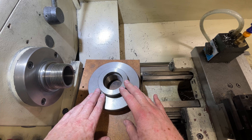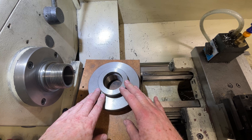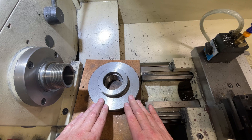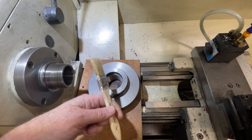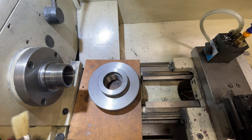If chips push the plate out of position during machining, then when I put it on the chuck next time things will potentially not be square. So I'm going to take a few moments to clean this — blow it all out with compressed air. I keep cheap paint brushes around just for this kind of task.